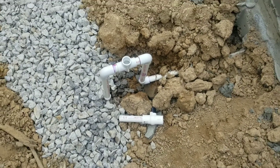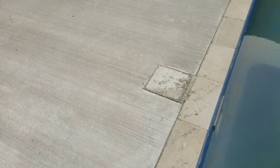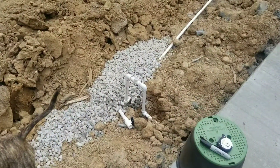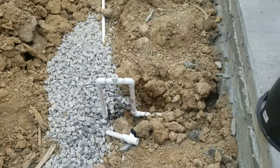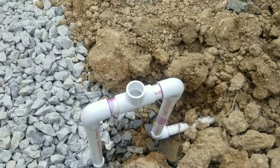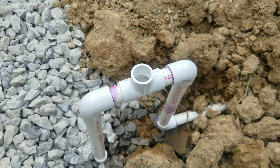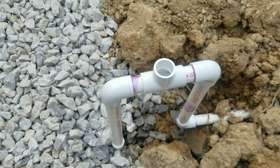So it comes in here — there's a hole in the back for an overflow valve, but because it comes down at an angle on a fiberglass pool you can't get the angle just right. That original line is going to be pretty low, and it's going to be dangerously low for your skimmer and your pump. This is how I overcame that, and it's a very simple easy fix. Me and my pool guy Mike basically thought this up together. I'm not a plumber but I can cut some PVC pipe — and so far I'm pretty pleased.